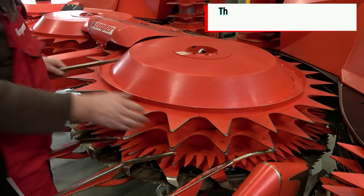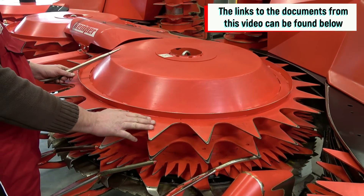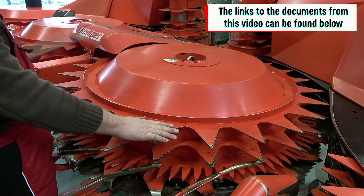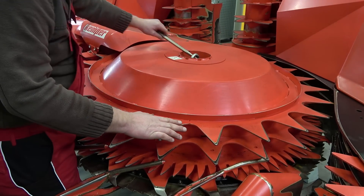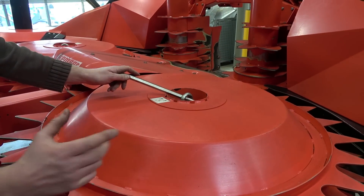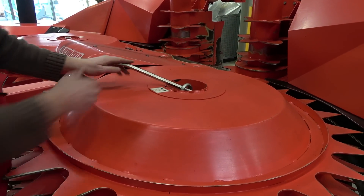Let's start by checking the gathering drum cleaners. The procedure is always the same on all drums. First, we have to remove the screws connecting the drum with the gearbox. That enables us to spin the drum — otherwise you cannot adjust the cleaners correctly.